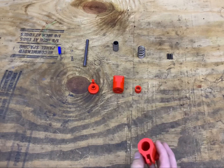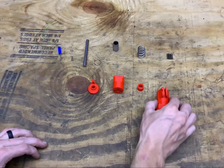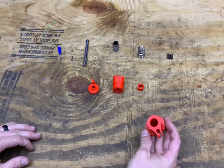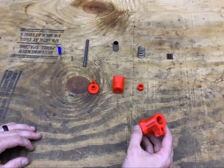Today I want to show you how to build a brake mod for the Logitech G29, G27, G25, or any of those models. It's basically the same as the TrueBrake made by AXC — more of a way to simulate load pressure rather than distance, still with a potentiometer.